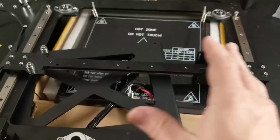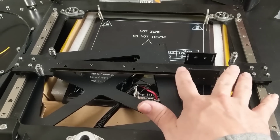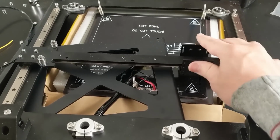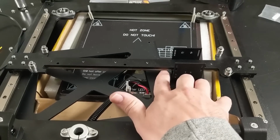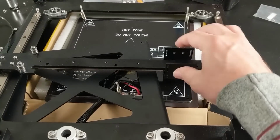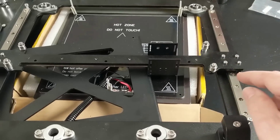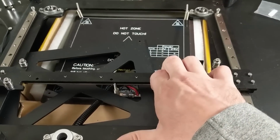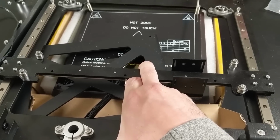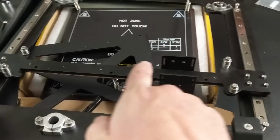While I have this frame portion in this orientation, I do want to tell you guys that this carriage has no wiggle and it moves extremely freely. So they use some nice high quality linear motion rails along with the pulleys, the actual ball bearings themselves, because if they didn't use high quality, then there would be wiggle. But it's not perfect on the rails. This does not move very freely. There's a lot of resistance, and in fact, I can sort of feel each little ball bearing. Basically, they just feel over-tensioned here on the 2 ends.